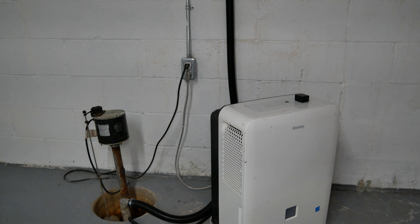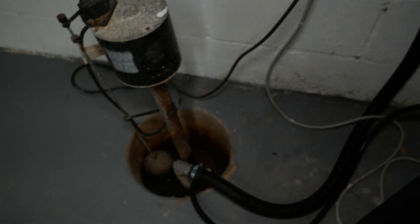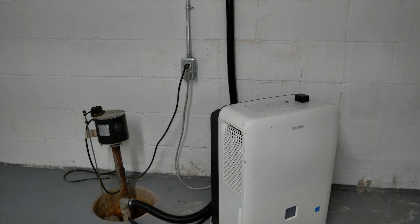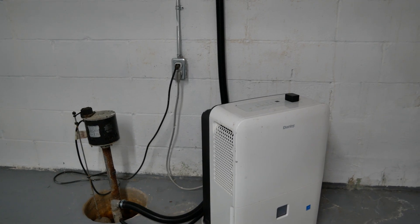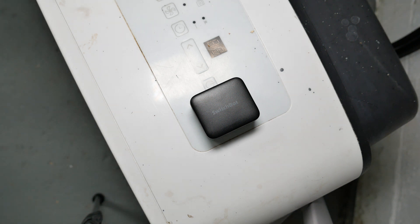Number nine, in cases where you don't need to manually touch a device, you might consider a smart plug. However, the issue with smart plugs is they can't handle high wattage. For example, hooking one up to your AC unit — which draws a lot of power — can be unsafe, as many smart plugs are not rated for those power draws. It's more hazardous. You'd much rather use the native plug that comes with the AC unit and just use SwitchBot to turn it on and off.